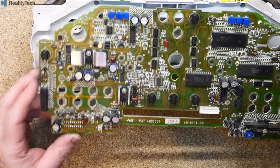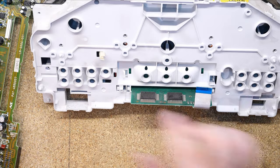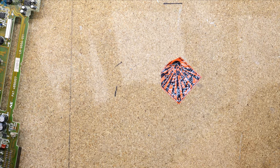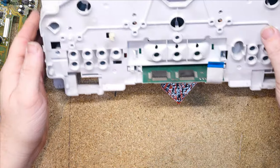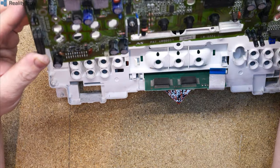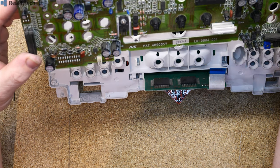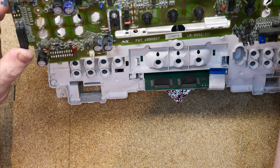So we've got this labelled as brake pad, this labelled as cruise, and that's on these end ones, and I can't really show you, but the one marked cruise is the gearbox fault light, and the one marked brake pads is not fitted, but the lights are most definitely there, so I'm inclined to believe that those lights may actually work if they're fitted.